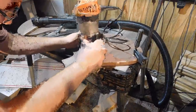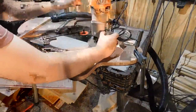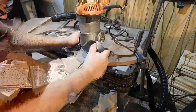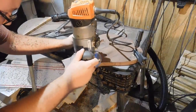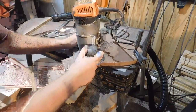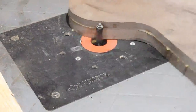I like using this method because it makes things easier toward the end — I don't have to worry about drilling holes, and it's a wider cavity that relieves a little bit of weight. It also makes it much easier to route your wires through, especially with several pickups and switches, since you have more room than a drilled hole. When you're drilling a hole you'd need an extra-long bit anyway. I left one edge un-routed, glued the two pieces together, and then routed that second pass with both pieces glued together. It came out pretty nice.